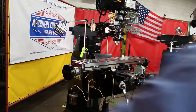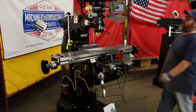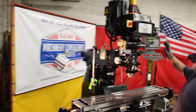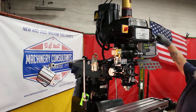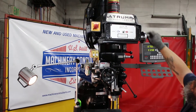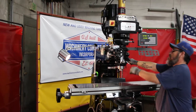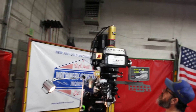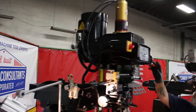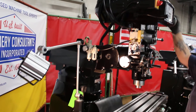Let's go ahead and see how it runs, Frank. Show them the new number two milling machines that we stock in Utah. Variable speed, two range, low to high — 55 to 4200 RPM. That's our high speed. What we've got there is a power draw bar that's air driven. It's the maxi torque.